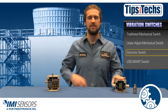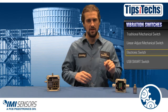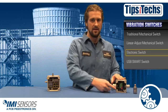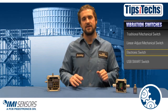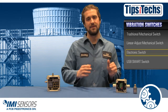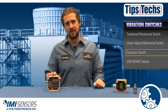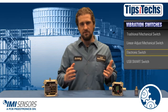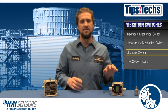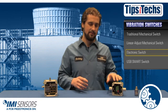Electronic switches have more capabilities than mechanical switches. The electronic switch has its own internal piezo accelerometer. It also has four pots which we use to adjust your set points, located right here. It responds to velocity and acceleration and has a 4 to 20 milliamp output making it easy to connect to your PLC. It can provide analog vibration data for your fault analysis. It is also a little bit smaller than the mechanical switch, making it a little bit easier to mount. The benefits could far outweigh the cost with this switch, and it is also the only electronic switch on the market that allows you to perform a self-test with your desired alert and alarm trip points.